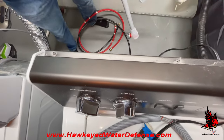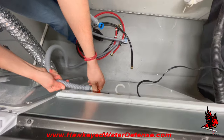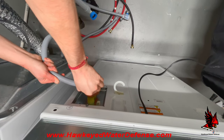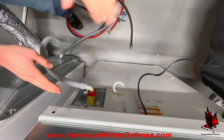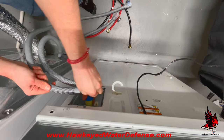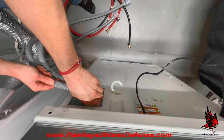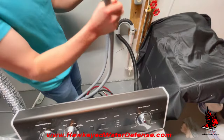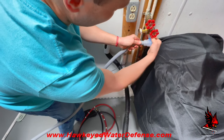In this case the cold is on top and the hot is on bottom. Take your hose — whether it's a generic hose or the flood prevention hose — and install it by turning clockwise and tightening until hand tight. If water seeps by for some reason, you can take a wrench and do a quarter turn — though this is not recommended. Connect the cold hose, and once connected to the machine, connect the cold hose to the hose bib. Hand tighten once again.